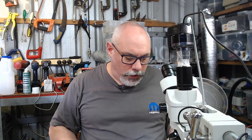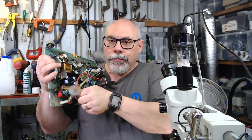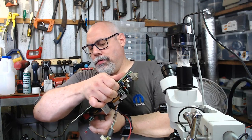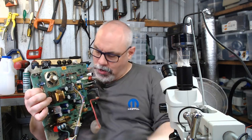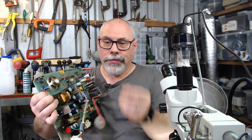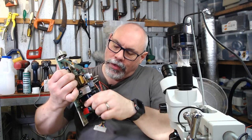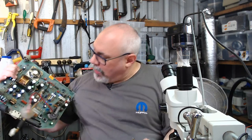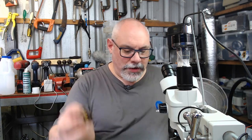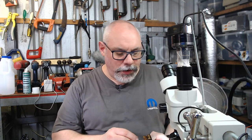All right. So let's now free the board, liberate the board of these horrendous capacitors. There's the Class Y. There's the second Class Y coming out now. And then here's our big fat Class X. We'll have a look at the board in a moment, but boy oh boy, this one did go quite spectacularly, didn't it? That's some gorgeous goo going on there. Yeah, we won't be reusing this.